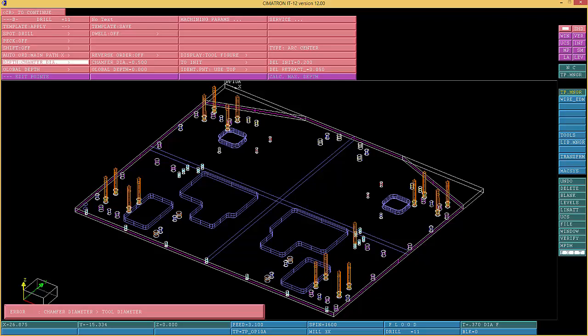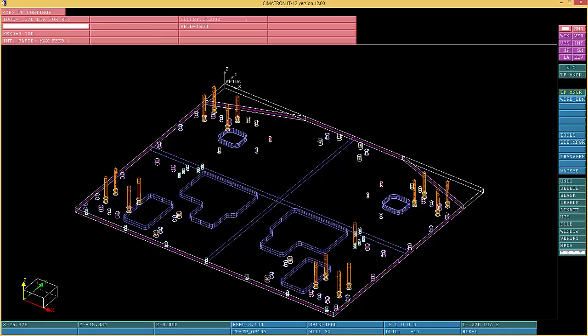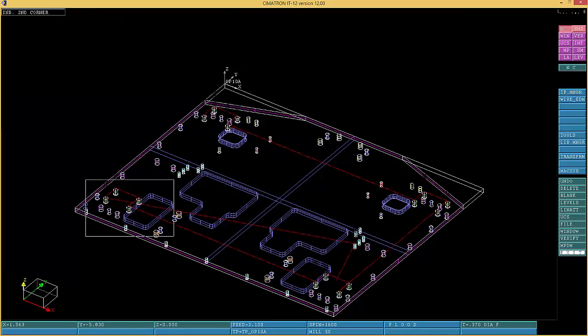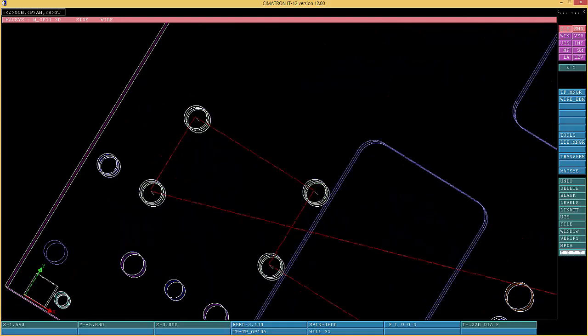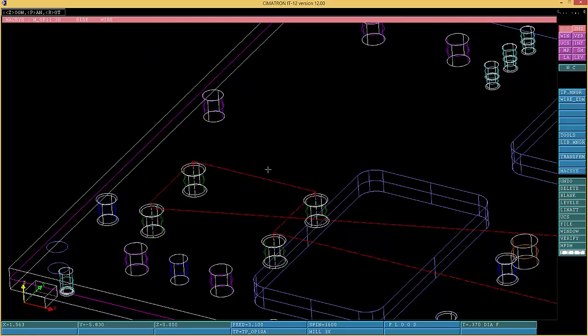And I just go do it. Diameter. Oh, sorry. You gotta go tip. You want to go through the part. The part's like a half inch. You go .650 to clear that out. .250 and RPM 1600, 3.1. Fine. Go for it. Boom. And that will be that. You see that? You can see you drilling over there. I go through. Maybe I gotta go a little bit deeper. Yes, deep enough, I suppose.